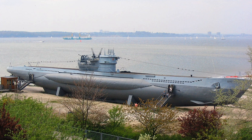Inside the outer hull there is a strong hull, or pressure hull, which actually withstands the outside pressure and maintains normal atmospheric pressure inside. The pressure hull is generally constructed of thick high-strength steel with a complex structure and high-strength reserve, and is separated by water-tight bulkheads into several compartments. The pressure and light hulls are not fully separated and form a three-dimensional structure with increased strength. The interhull space is used for some equipment which does not require constant pressure to operate.